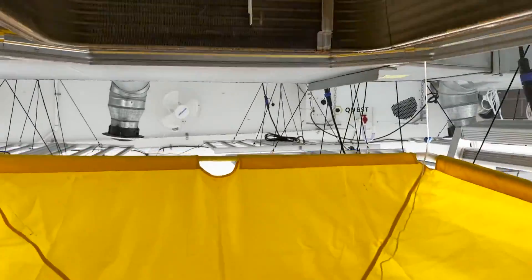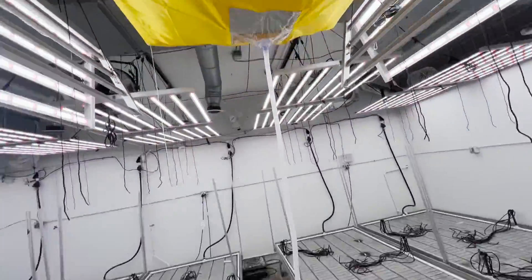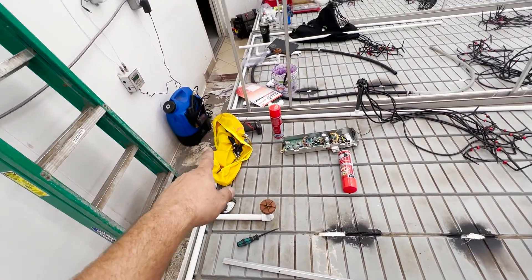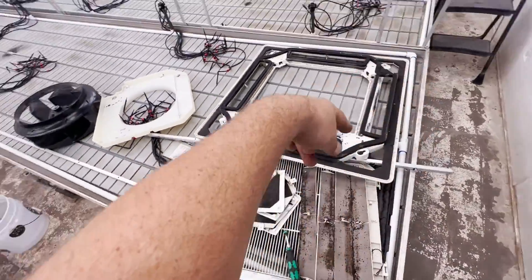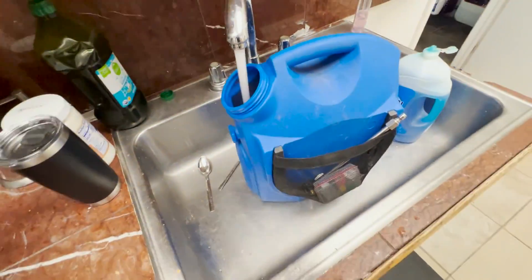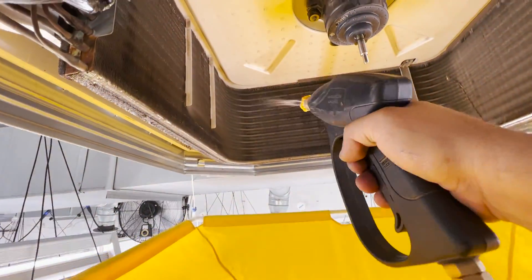These are a little more difficult to work around than the mini-split high wall kits. So we're gonna start with a rinse, just get off what we can. Then we'll go in with some soap, let that dwell for a minute, rinse, and see where we need to go. It may take more than one round of soap — it really just depends. Once this is clean, we'll let that drip and then take some time cleaning these parts individually. Use hot water.